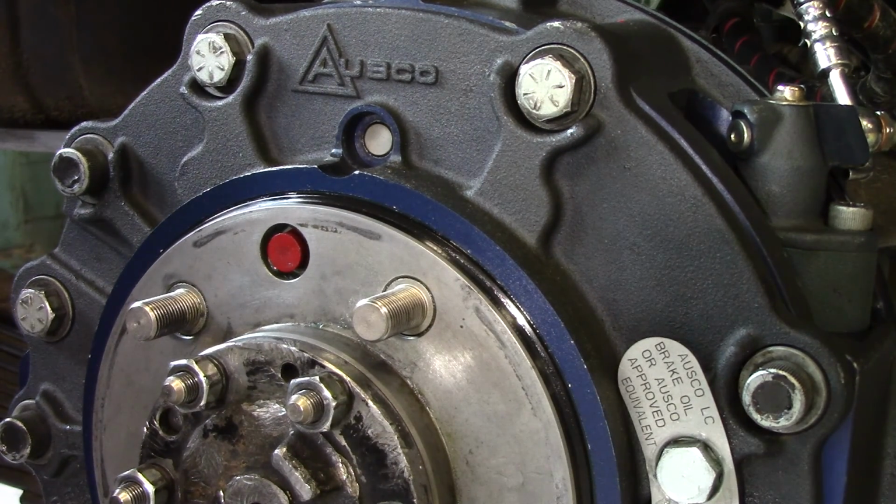Now anything over 7.62 millimeters, anything higher than that, is considered a brand new brake. So obviously this is a new condition brake. Anything 6.48 millimeters and lower is considered fully worn, and you don't want to use these brakes any further than 6.48 millimeters. It would then be time to change out your brake with your spare and send it in for rebuild or whatnot.